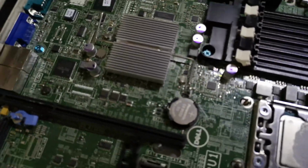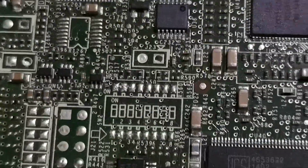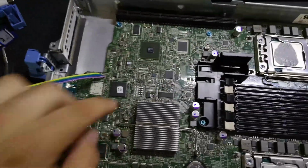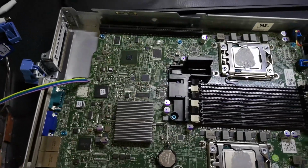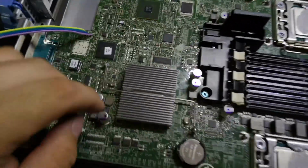So, I'm seeing posts for, again, an R720, but I had noticed this switch header on the motherboard, SW2, and I hadn't poked around at that yet. Someone mentioned that they were poking around that on the R720, I think it was, and switch number 1 interrupted the boot process, or rebooted IDRAC, like that boot process in serial, and that is what 1 is doing. But number 2 is not interrupting the boot from what I can tell, but maybe I need to hold it longer. So I'm going to solder a jumper, I think.